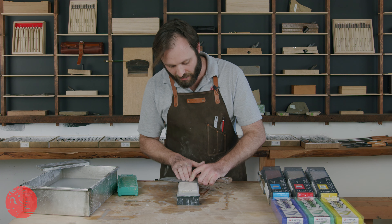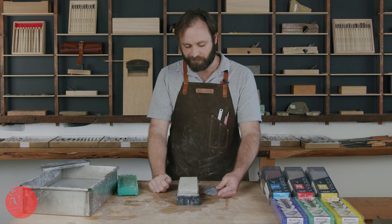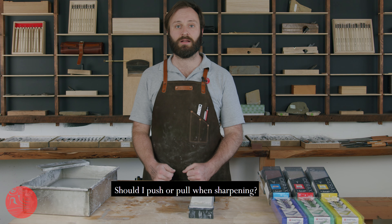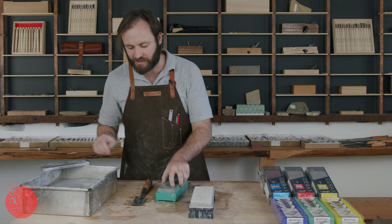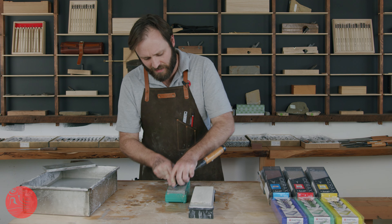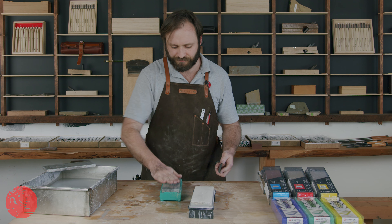Cutting into the top of a stone — I've done this once, sharpening a kitchen knife on an 8000 grit stone. In this stone we have a little chip out of the surface, which means we now have an area we can't really use. We can go above and below it though. I think it happened because I was at too high an angle with too much pressure and just cut out the top of the stone. The knife was fine. Over the course of flattening and continuing to use the stone, I went through that hollow and now it's flat again. So if this has happened to you: adjust your angle, go gentle, not too much downward pressure, and pay attention to what's going on.